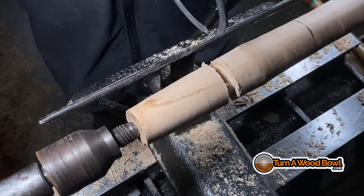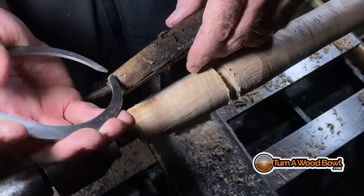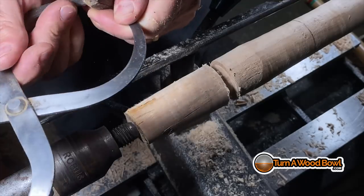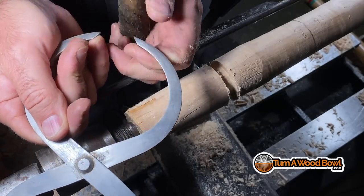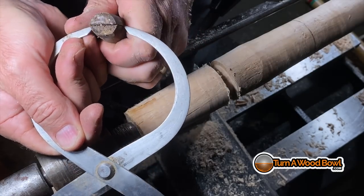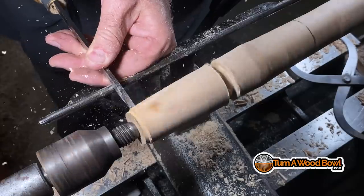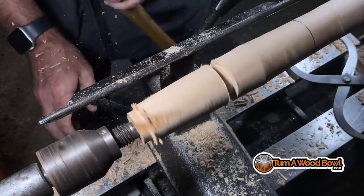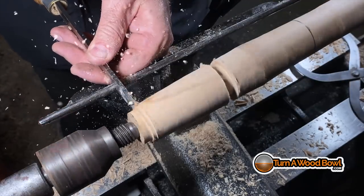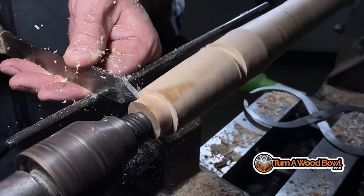Straight in is a scraping cut — you're just tearing away fibers that way, not truly cutting. I'm going to get a measurement at the end; there's a relief cut into it that's been compressed, so I'll turn that width first. The parting tool is really nice for quickly removing material from a small area. You can see the peeling cut a little better here — see how the blade is engaging with the top portion of the wood as it comes around.